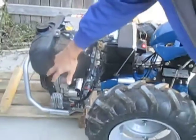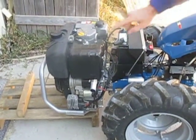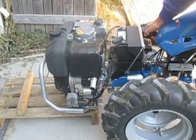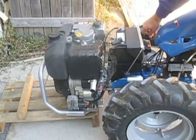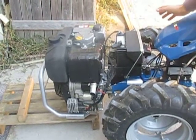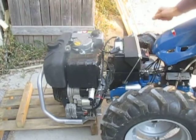Now I'm going to turn it off. Notice as soon as it turns off, the light turns back on. On a key switch panel mounted up front, there's an A light that does the same thing — the A light and the battery light are both alternator failure lights. This is why it's very important on the diesel engine that when you shut the engine off, you have to come down here and turn the key off, because the key does not shut off the engine on a diesel. The electrical system only starts it; it doesn't shut it off. You have to shut it off with a manual kill switch and then shut your key off. Otherwise, that light is going to run your battery down.